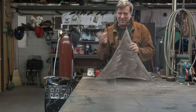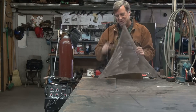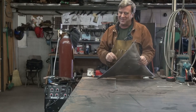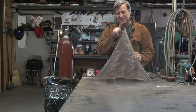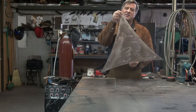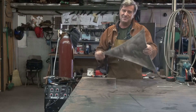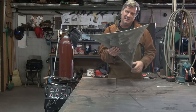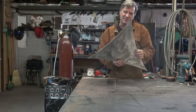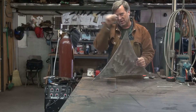The next part of the umbilic torus that makes it what it is: instead of all of these just going this way all the way around the shape to make the whole ring — no, we've got to make it harder than that. If you start here at zero, each one will rotate as it goes around the ring until you finally get back to 120 degrees. Remember, this was our starting point, so you'll finally get back to 120 degrees as you turn all these rings all the way around this structure and weld them all in.